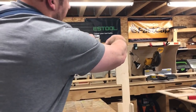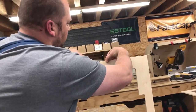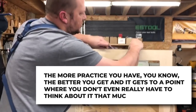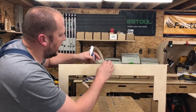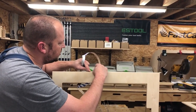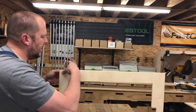Because this isn't a fine piece of furniture, I'll just line up one side with my finger nice and even, and as I'm pulling I'll pull the tape out from underneath and just get it going. Edge banding is one of those things where the more practice you have the better you get. A lot of times I'll pre-cut this so I'm not handling a big bundle, but for today's illustration I just wanted to show how easy it is to put on.